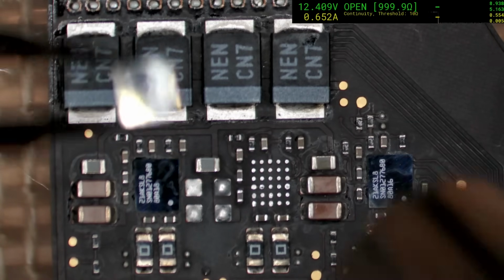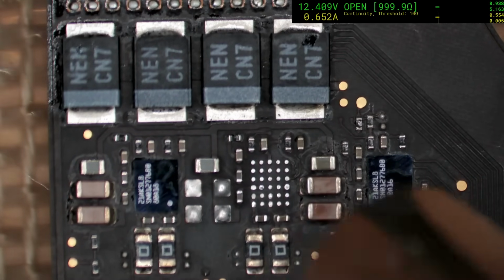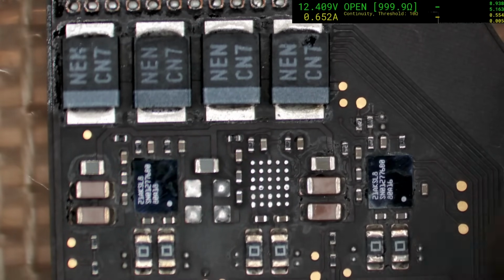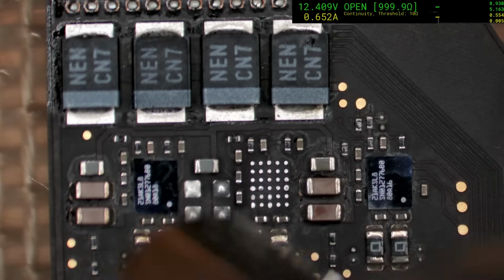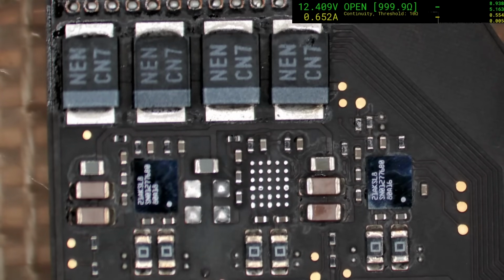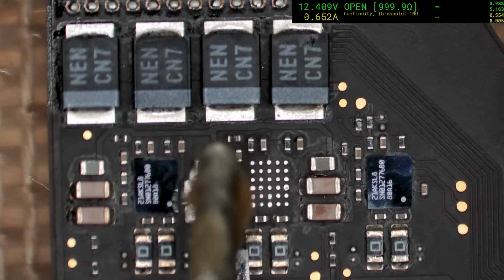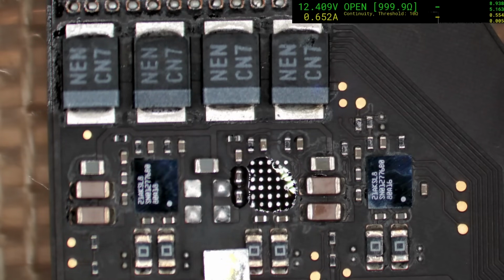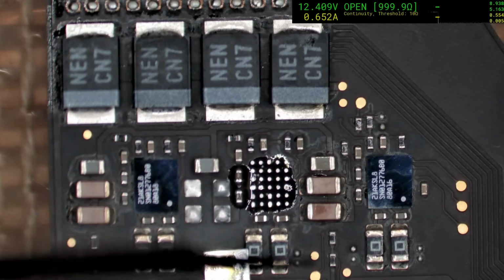It's going to preheat the board a little bit. It's been sitting for a while, so we kind of want to get a little bit of warmth into it so that when we put this chip down, we're not sitting there for a minute cooking the chip while we're waiting for the board to come up to temperature. Okay, that should about do it. And we're going to drop a smidge of flux. Draw that out. There we go, there and there. Looking good.